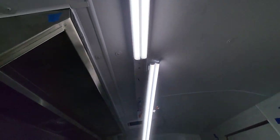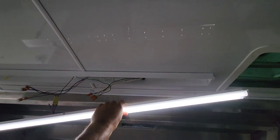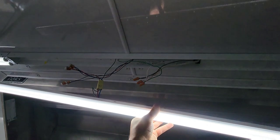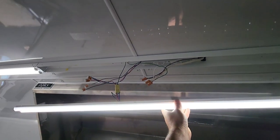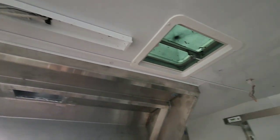What I like about these lights - and why I started using them - is that they help support the roof a little bit. Whether you have FRP or white aluminum, the fixture grabs a couple of studs on the left and right, so it acts as a nice anchor piece. The wiring is straightforward: black is the switch leg, white is the neutral. That's how I installed these lights - pretty easy. I've got the eight-footer and four-footer up; I'm still waiting for my two-footer.